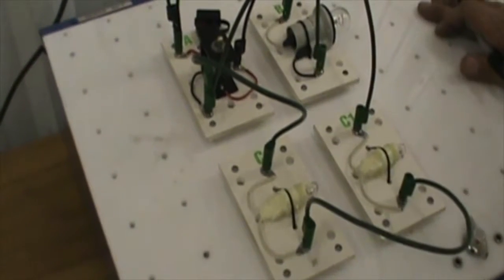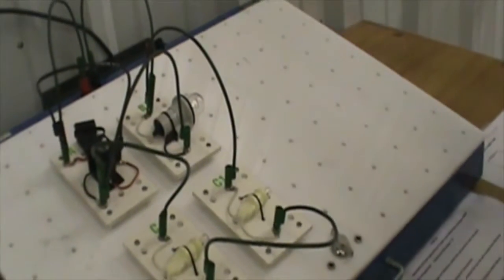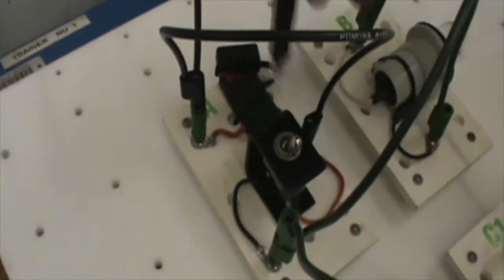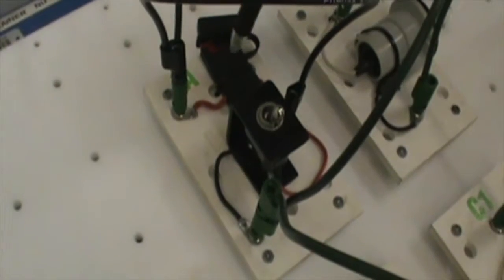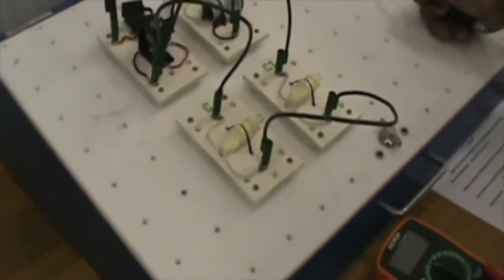Once again, I am stressing this: this entire circuit is fuse protected. It is not fuse protected. If you look at how it's laid out through the fuse and through the switch, we still have that jumper in here. We've got to always check and see. This is an issue with many machines — people do put jumpers in. You've got to be able to study and decipher: is it fuse protected or is it not fuse protected? That's a very critical, important point.